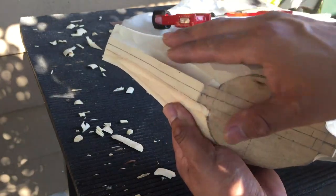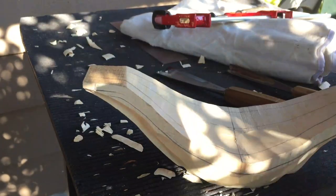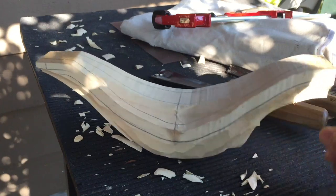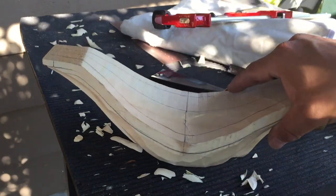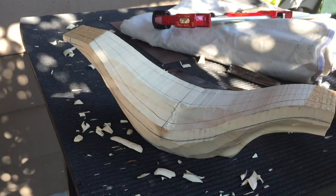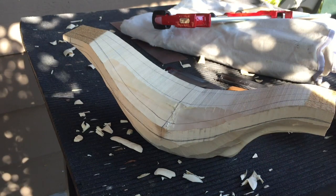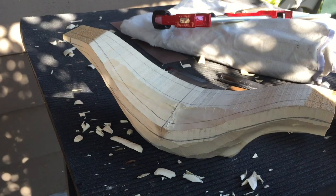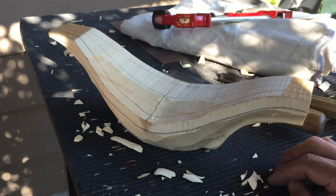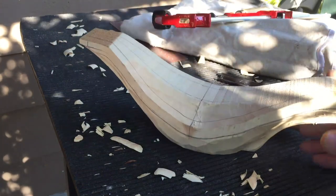And we'll do a little bit more blending, and then from there, we'll start taking out of the middle. Once you've set up the canoe with all your planes and your gunwales and your center lines and all that kind of stuff, the actual work of taking it out goes pretty quick, especially if you're working with some good chisels. Hand tools, it comes out quite nicely. And then when it comes to the finishing portion of the bowls, you'll move to traditional tools, so your bent knives that we made earlier in another workshop, you can use them. And right now, we'll just do this other side, clean up a little bit more, and then we'll start hollowing it out.